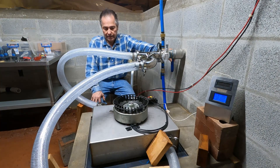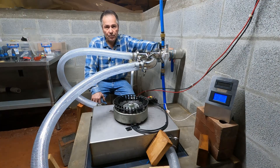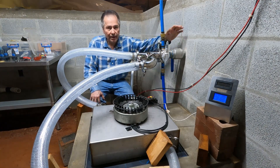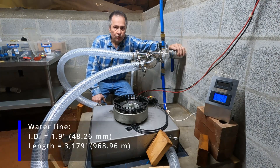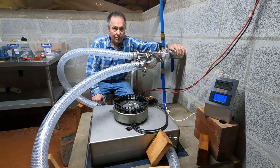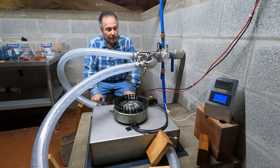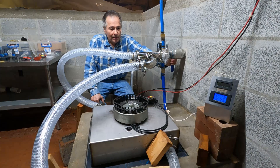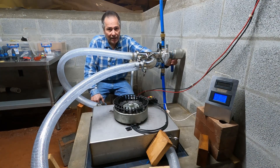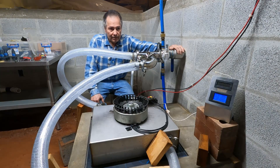So that is the end of this episode until I get more jets cut up and maybe a few more wheels to try to increase our power. But we're close to the maximum we can get out of this water line. This is a 2-inch water line running 3,200 feet to the top of the mountain — it's very small, definitely not adequate. A 3-inch line would have given me about 1,400 watts versus about 300 watts. So never use a 2-inch line — always go 3-inch. It's over half a mile of line, a big expense.